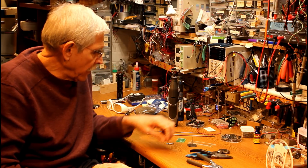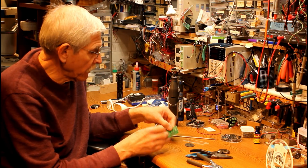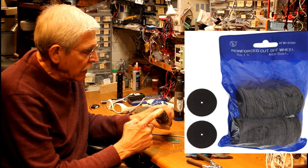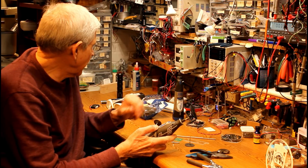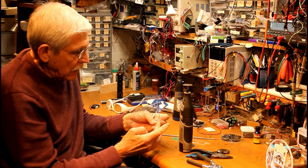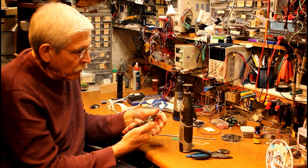Quite frequently when I'm working at my bench, I'll need to cut something — whether that be a bolt that's a little bit too long, a piece of brass tubing, a piece of stainless steel, piano wire, plexiglass, or sometimes circuit board. The tool I frequently reach for is a Dremel. The cutoff wheel I have in here is reinforced resin fiber and it cuts through darn near anything — all those materials, along with wood, different types of plastic, and it'll even scratch or sometimes cut ceramic and glass. If I want to shorten a bolt, I'll first wind a nut onto it — that gives you an opportunity to wind it back out and clean the thread when done. Then I grab the bolt with what are called parallel jaw pliers.